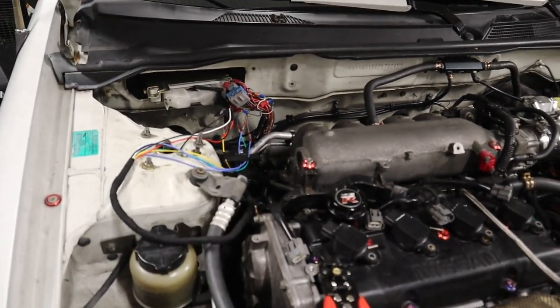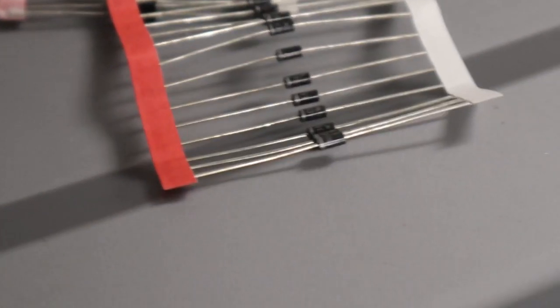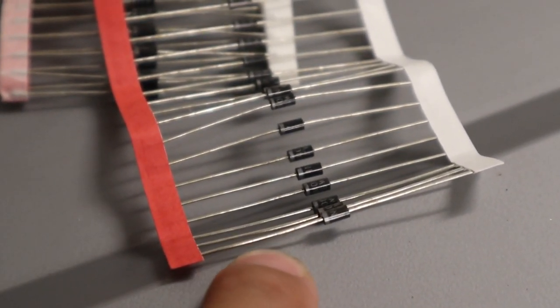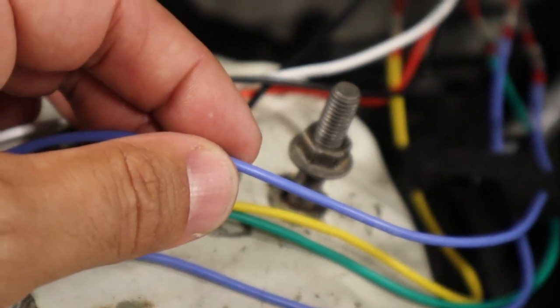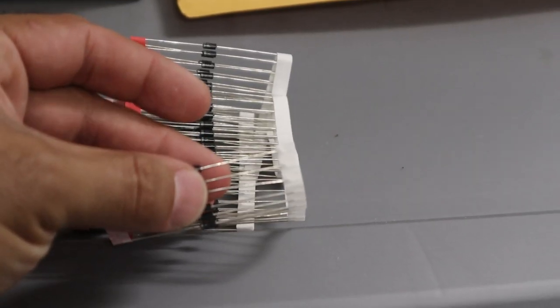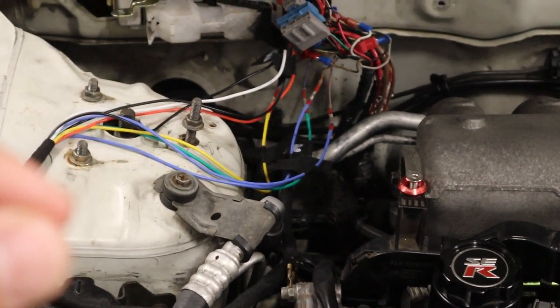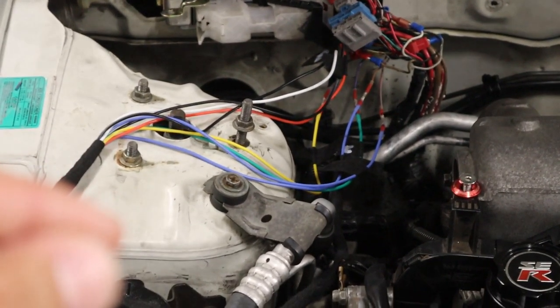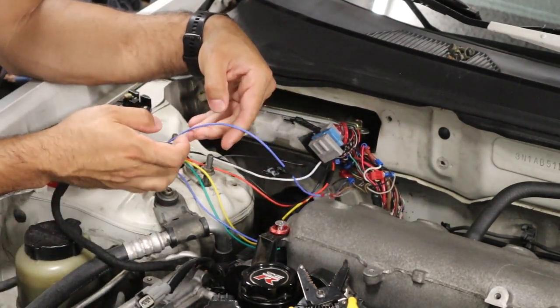So after thinking it through, I think I got it. I'll grab the diodes and cut them to whatever length I need because these are too long. Then I'll cut the wires, peel back enough on each end. I'll grab whatever's left of the diode, slide it inside of the insulation on each end, and leave enough to where I can solder the strands to the diode as well. Then heat shrink it. Let me go ahead and do one and show you guys what I mean.